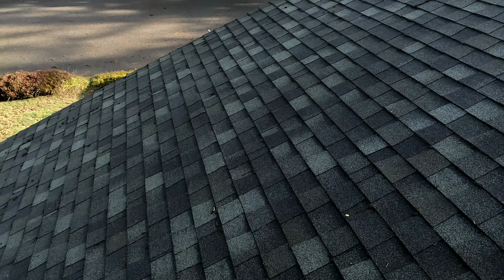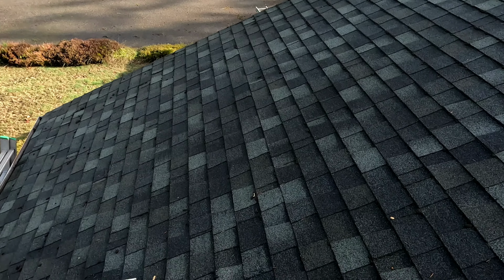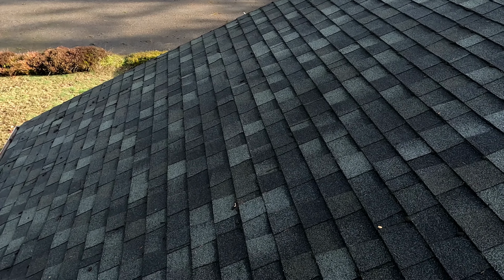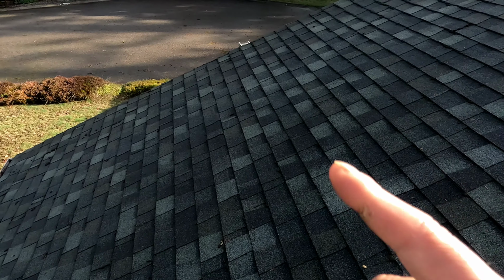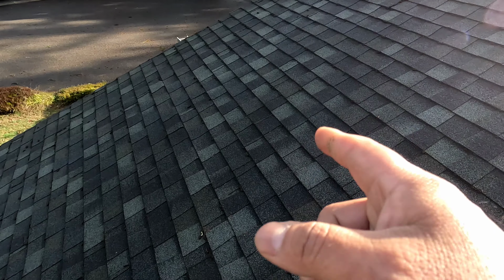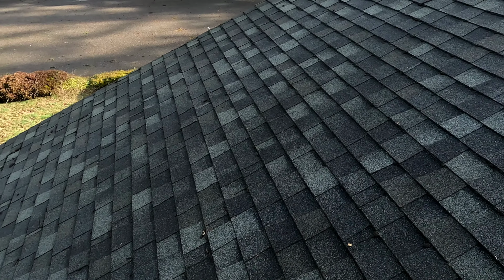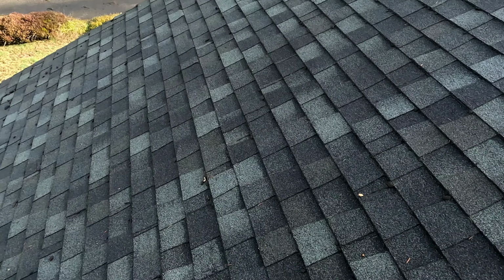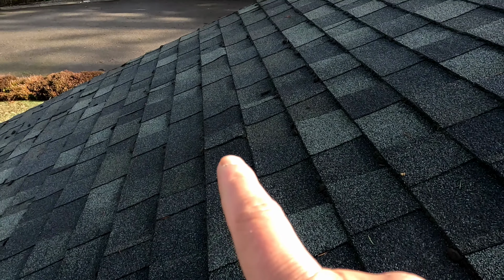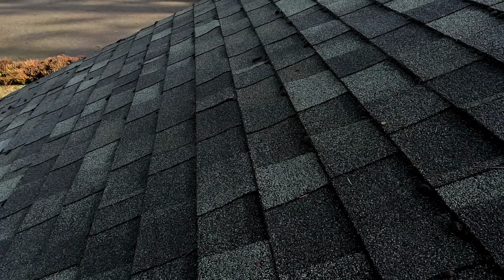Today I am here in the Kirkland area. I am about to do a roof repair. There are multiple leaks in this area. There is a bedroom in this home, down there, this area of the roof. And when I was checking here, I noticed one thing: that the plywood from there all the way here is pulpy, like mud.